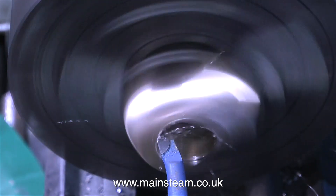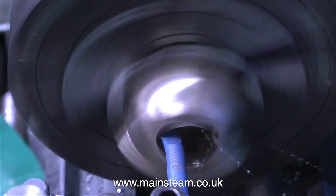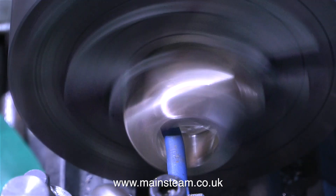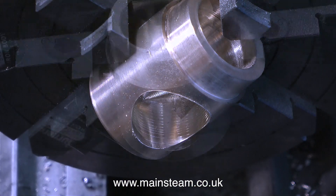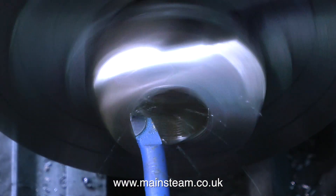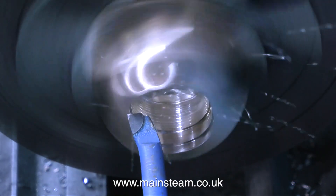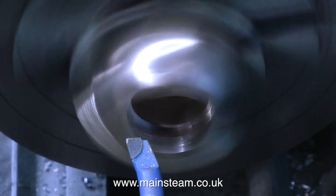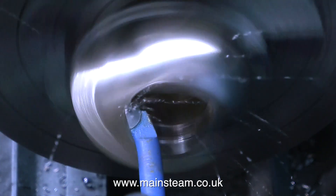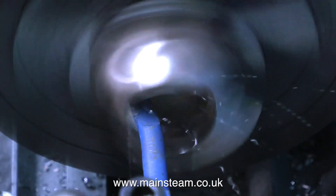I'd like to make it clear that I'm not going all the way through this piece with the boring tool or the drill. I only drilled halfway through. And now with the boring bar I'm opening up the hole so it will fit the copper tube that's going to be the chimney. But I don't want the copper tube to go all the way to the bottom, so I'm stopping the boring process about three quarters of the way down. This will securely locate the chimney without letting it fall into the bottom of the hole.